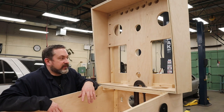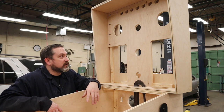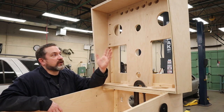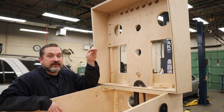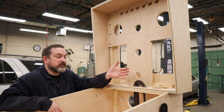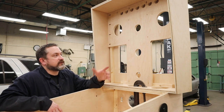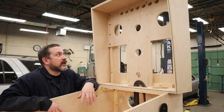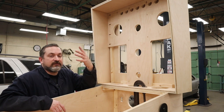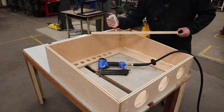And then one of the last things you probably want to think about is if you ever had to change this brace out because you had to change a monitor in the future, how does it come out, right? So we're not going to be gluing this in, and I've decided to turn it around and make it so the pocket hole screws come in from the front side. And the reason for that is because if you think about it, everything else comes off from the front. So your speaker panel comes off, your glass comes out, you can undo all the bolts on the VESA mounts for both monitors that come out this way. And as long as everything else is just screwed in and not glued in permanently, then this can come fully out. That way you can change it if you need to later. All right, let's take this all down and glue in those glue blocks.